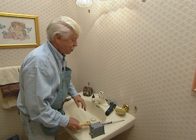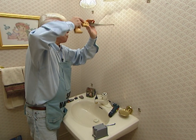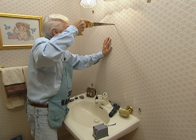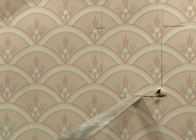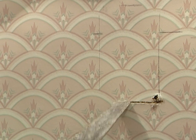The next thing we need to do is take a drywall saw or keyhole saw and start in a corner right here. Just by twisting, you're going to go right through the sheetrock, and now you can turn your saw around and start cutting. You don't have to worry about being exact here because it's all going to be covered over with the mirror, but we do want to get far enough over so the box will fit in there.